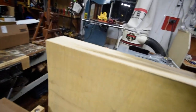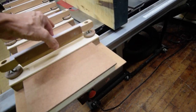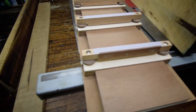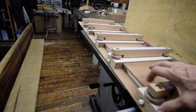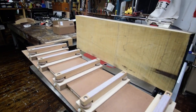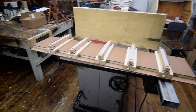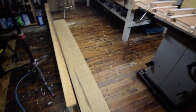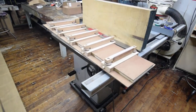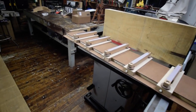All it is is a series of little slides where you have screwed in a little ¼-20 machine screw, and these little wheels just raise and lower the supports. There's a little piece of self-adhesive sandpaper to stop things from sliding around. When you have large boards — like I have some 12-quarter and some 8-quarter lengths of poplar here — I made mine four feet long, but you can make it any length you need. I generally work four feet and under for this heavy stock.